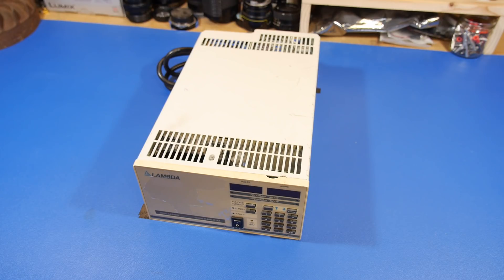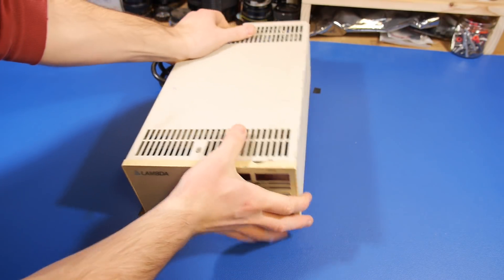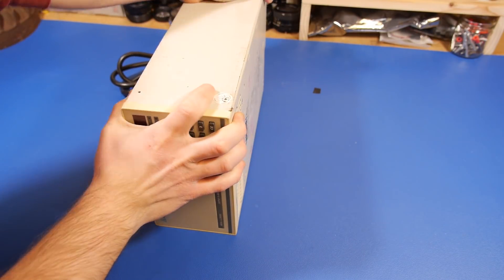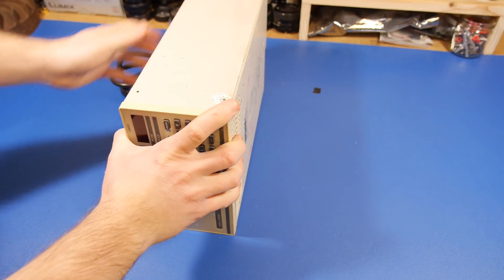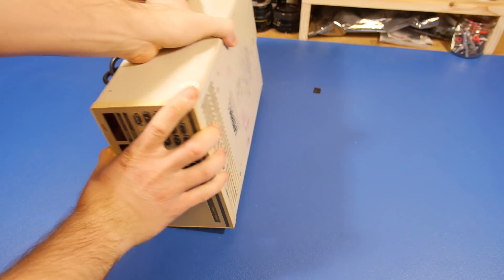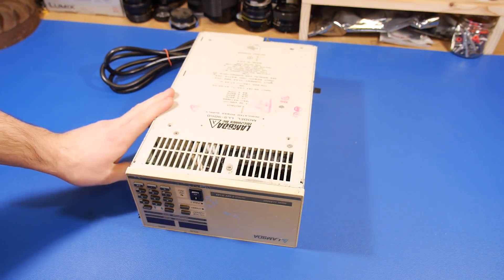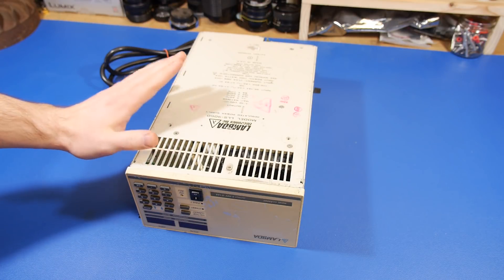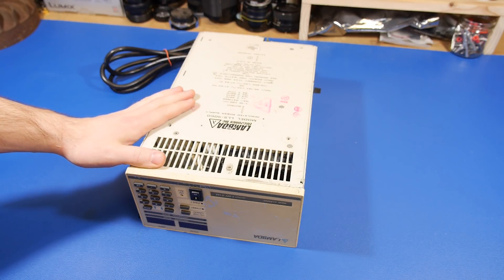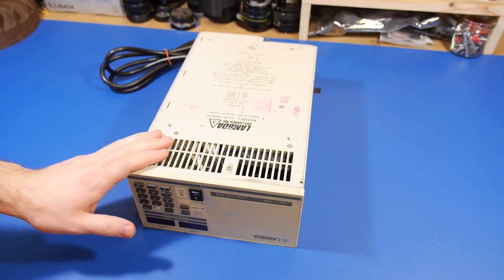This is a quick look at the build quality and overall construction of the Lambda power supply. It's unbelievably rigid — it doesn't flex at all in any direction. I could put a bunch of force on there and it just doesn't go anywhere. The build quality is just unparalleled; it's very robust. It's 16-gauge sheet steel — not sheet aluminum like a lot of other units. The weight is up too, but the construction is also different.